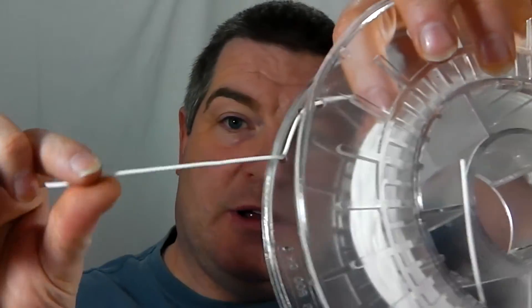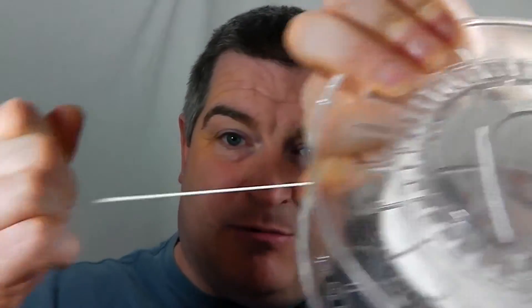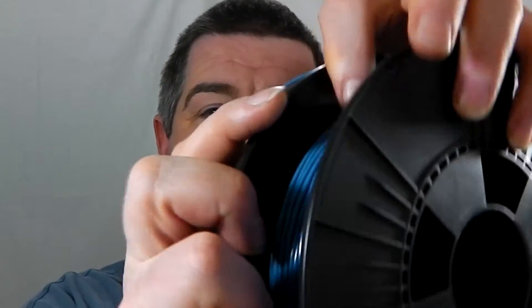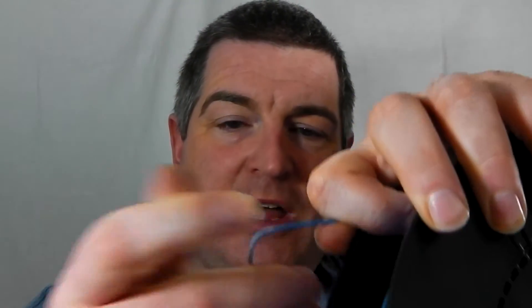Hi and welcome to today's video. We're going to structure things a little different today because I want to talk about NinjaFlex 3D printing filament. If anybody hasn't seen NinjaFlex before, it's bendy - I'm stretching it there, not just moving my fingers. It's got over 100% stretch on it. Compare that to normal ABS which is very rigid - you can't even bend it, it stays where it is, and if you kink it it goes a horrible color and you've got to cut that bit off.